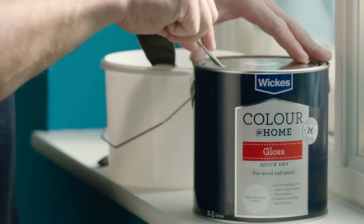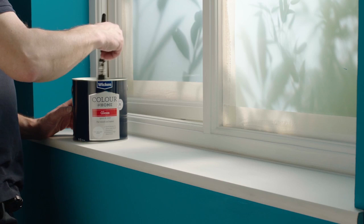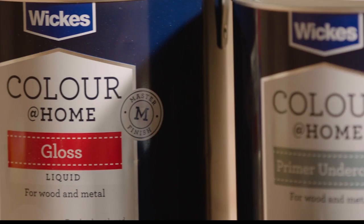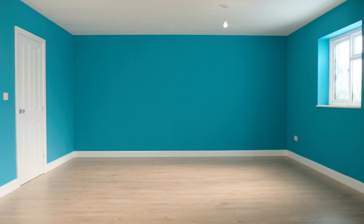Paint Woodwork Top Coat. You're now ready to apply your top coats. It's best to put two coats on woodwork for a longer lasting and more protective finish. We would recommend using a water-based product as they are quick drying, don't smell like solvent-based paint and the white options don't yellow. We're using a gloss paint as our top coat, which will give a shiny finish. You can opt for a satin, eggshell or matte finish, but it's all down to personal preference.